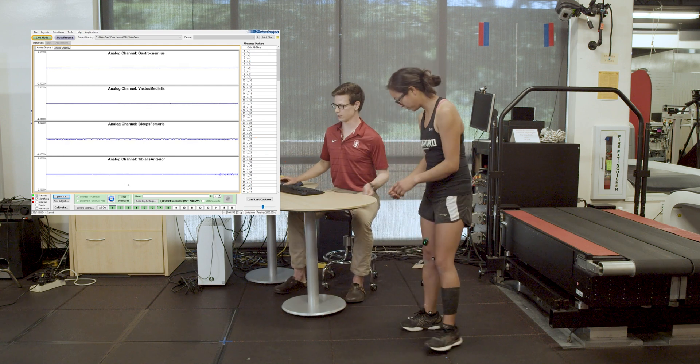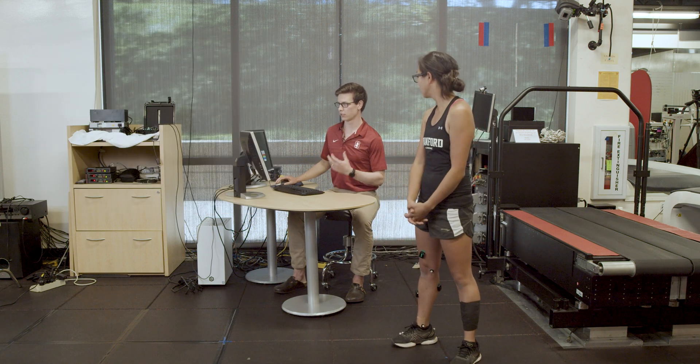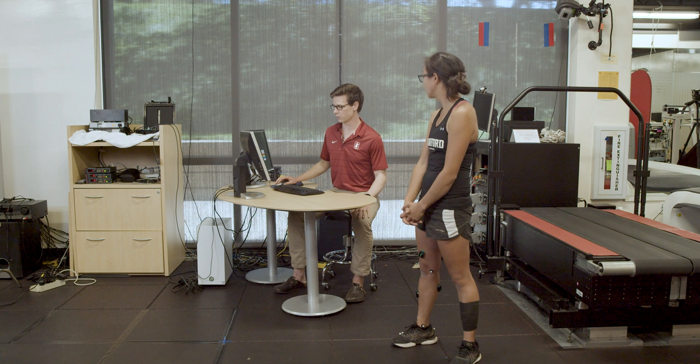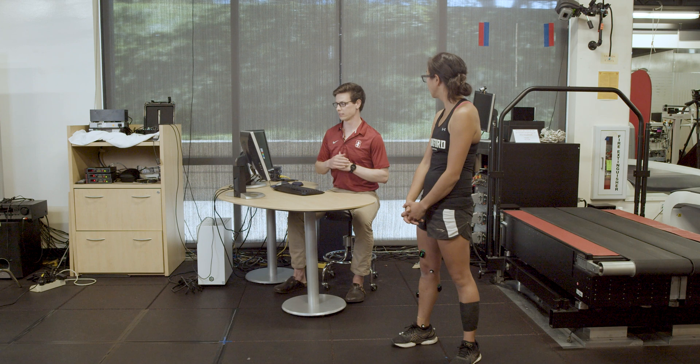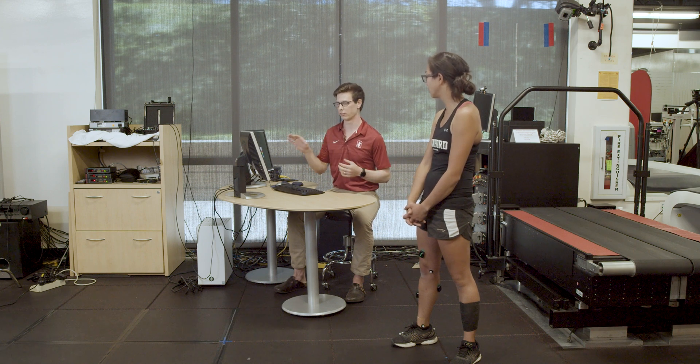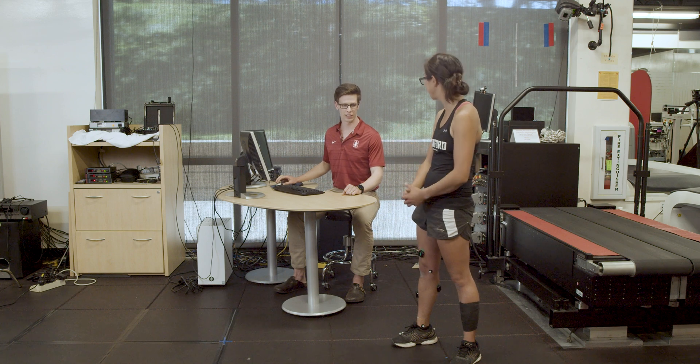As you can see, these signals are very noisy. To turn them into a zero to one activation, we bandpass filter them, make them all positive values, then apply a low-pass filter, ending up with a waveform around six hertz. This is called the linear envelope of the EMG. Now we're ready to capture EMG in our experiment.